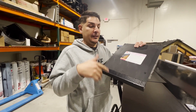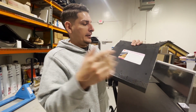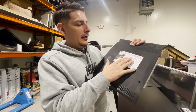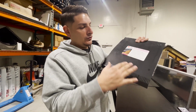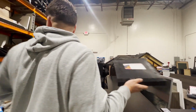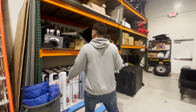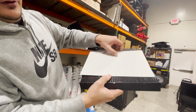Guys, we put this video together and I was actually about to drop it, but I just want to show you guys the proper intake ventilation, right? So this stuff is Owens Corning inflow vent. It's made specifically for intake. So what you have is this, and the shingle will actually cover this up. Let's just pretend this was a shingle. So the shingle will cover it up and it'll go down to there.